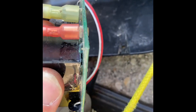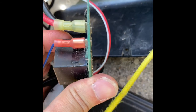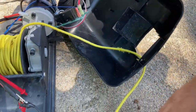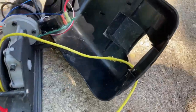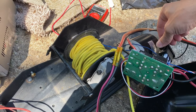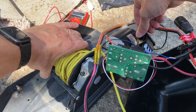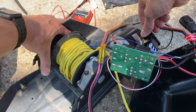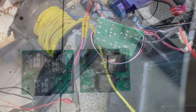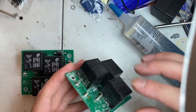By the looks of it, there's some corrosion underneath this board. I've got this contact cleaner here. I'm going to power off, spray this board, and make sure everything is disconnected. So we got this all cleaned up. Yep, it's still a relay problem. Just remember that I sprayed the contact cleaner on here, so this board did not originally look this way.